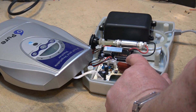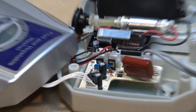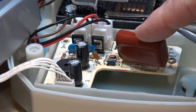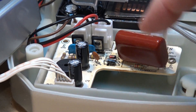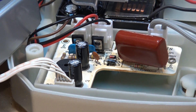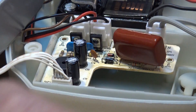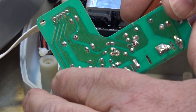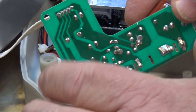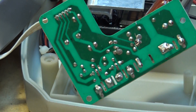I just happened to touch this capacitor. I do believe we may have a problem right in this area. You can see some sparks underneath there. I think we may have a connection problem on this capacitor — this could be a very easy fix. Let's take out the circuit board. Let's make sure it's unplugged — it is unplugged. I move this capacitor and we can see the problem right now: it wasn't soldered properly at the factory. There's our problem — let's solder that up.